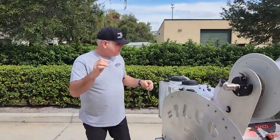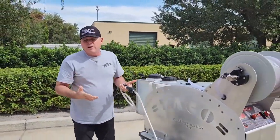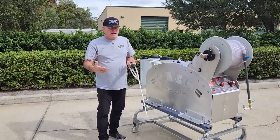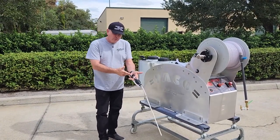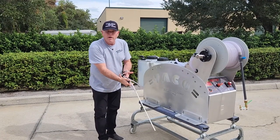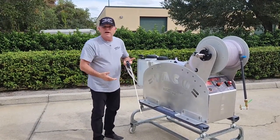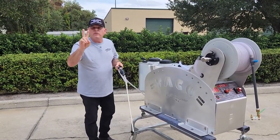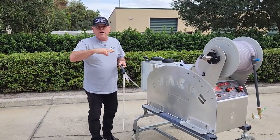200 square feet. Remember, I told you your soap is static. So what we have included with this is a soap stinger. Whether you're using soap in a 5 gallon bucket, or in a 1 gallon bucket, or you want to hook this up to an auxiliary tank, we've got a nice little on-off switch here, a primer ball for priming up your soap, and of course, a draw tube for putting down into that 5 gallon bucket. And this is static. It's always at 2 ounces per gallon. You don't have to think about setting your soap valve at all.